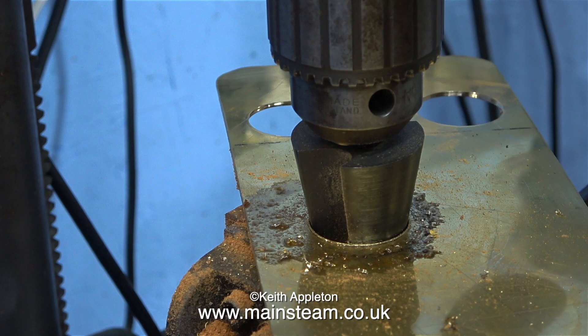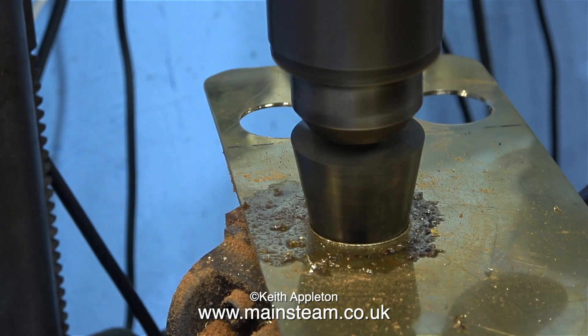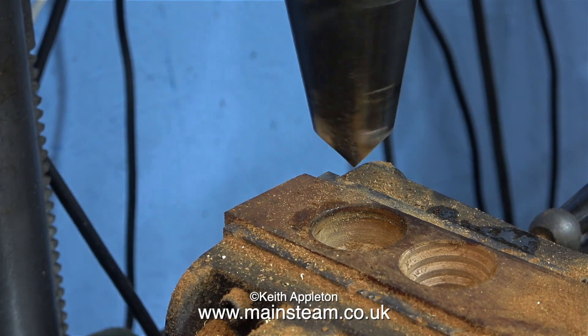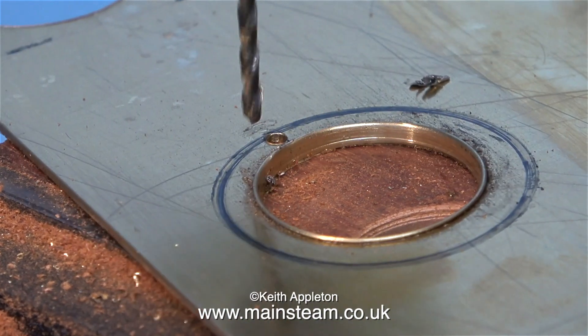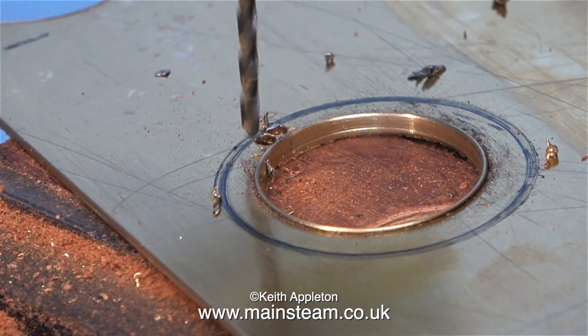What makes it more difficult is that this machine is quite old, made in the UK, long before things changed over to metric. I decided to give this up as a bad job as it was going nowhere. Time for Plan B: use a 1/8th inch drill and go all the way round, drill the small holes, join up the holes, drop out the centre, and then clean up the mess.